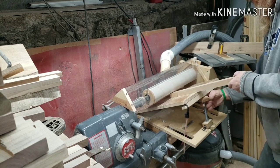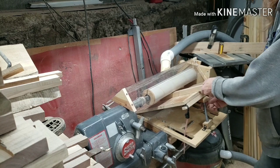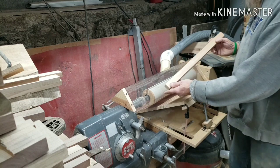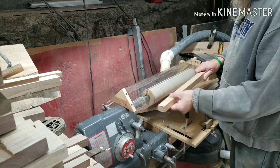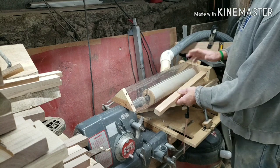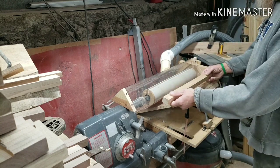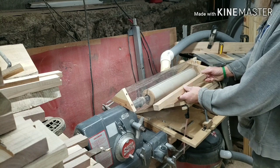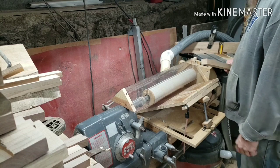These are strips that I have milled up and run through the planer for butcher blocks, and I still get a little bit of snipe sometimes. In my process I could run them through the jointer, but it takes off too much material. Usually I can just run these through the drum sander real quick and get a dead flat surface. Let's test this thing out.